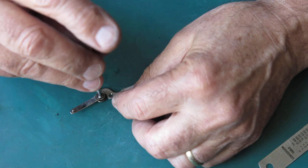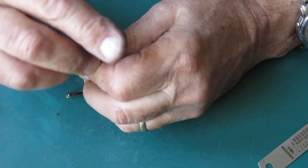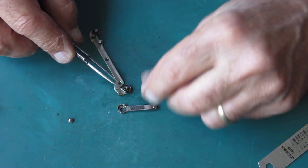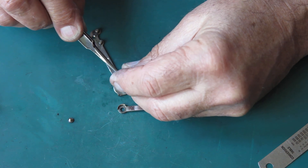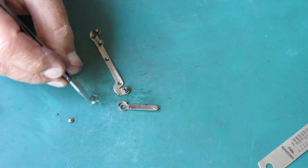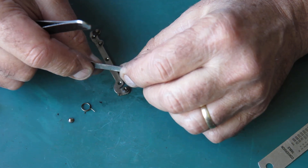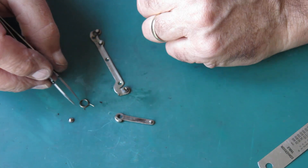It's got some black paint around the tip of the head - I don't know whether that's paint that began its life there or whether it's stuff that's scuffed onto it. Now it's coming loose. There's the arm and there's the spring in question. Now it simply lacks enough power. I can tighten it up by bending the ends of the spring, but I suspect that's not really going to make an awful lot of difference - I think the simple answer is that it's just not a heavy enough spring. I'm not convinced that this arm was ever that shape too - it's probably bent. It was probably straight through there, and that won't be helping its action at all if it's trying to pull sideways.